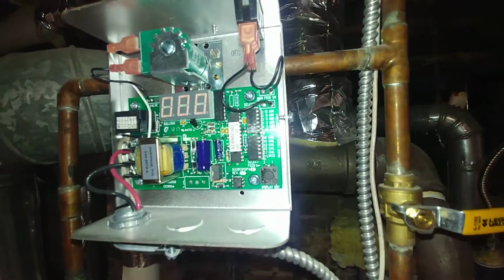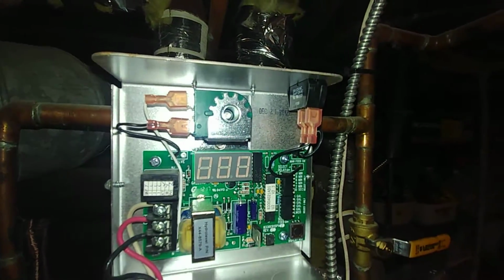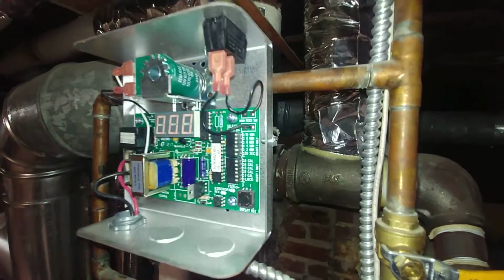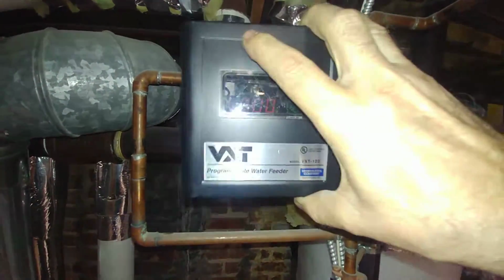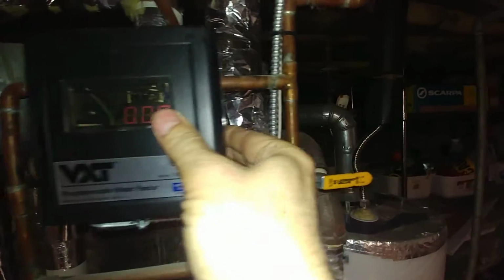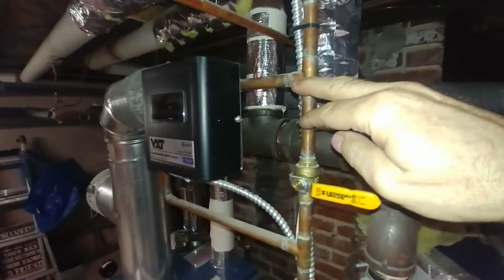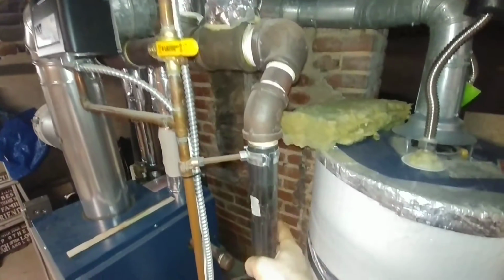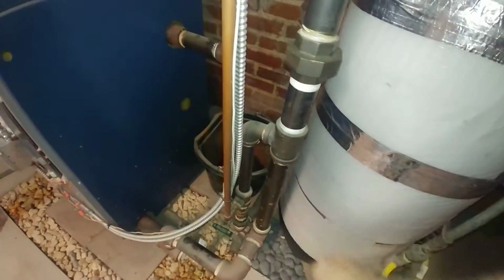and the electronicals, power transformer, and the green coated solenoid for 120 volts, and the setting switches and reset switch. It had only fed approximately 12 gallons since we installed it, so it's a very nice and tight system. This is your manual feed. Getting back to this is the equalizer line and the Hartford Loop right there.